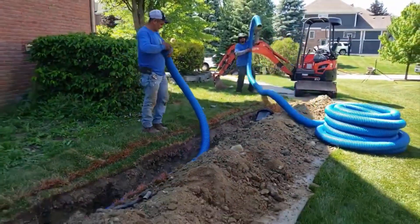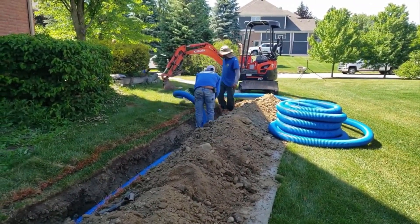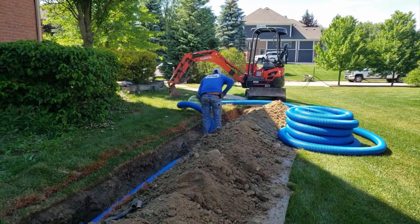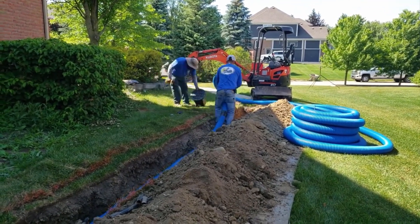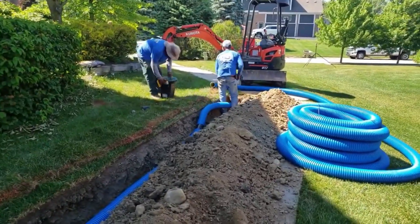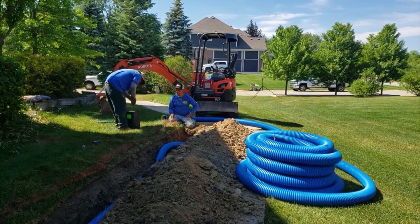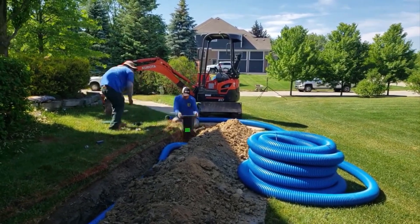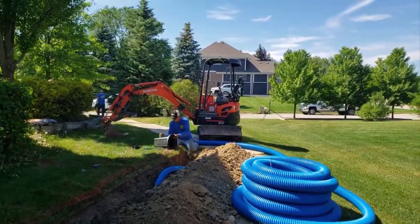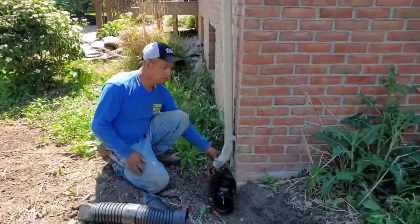This is a solid yard drain pipe. The high-octane royal blue comes in solid or as a French drain pipe — which has a very open inlet of eight slots per valley and takes in more water than any other pipe in the world. We're using the solid on this job. This is a roof runoff system. I always get people in the comment section saying: hey, where's the stone, where's the drainage fabric? This is not a French drain — this is a roof runoff system, all solid pipe. We're teaching you how to do a complete roof runoff system. If you're just managing your roof runoff properly, you might be shocked — your yard might not even need a French drain.